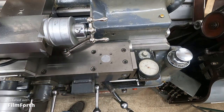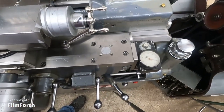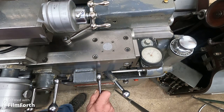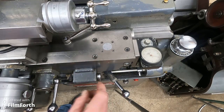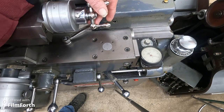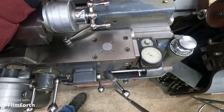It's got a cool retract on the top slide — a lever retract. The Monarch here has this dial stop, so you can get back to your depth. But when you're engaging these half nuts and it comes up and you're trying to get them in, you can try to stab them in. If they don't go in all the way exactly as this thing's spinning, then the carriage is going to lag from your last cut. You notice that problem especially on lighter weight machines, and even heavy machines. I've heard it referred to as camming in air of the half nuts.